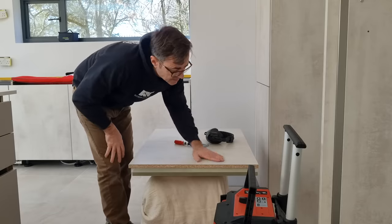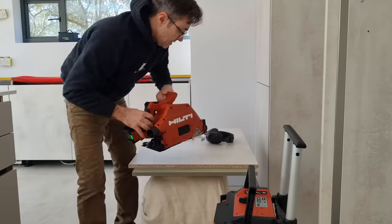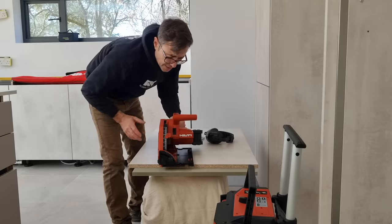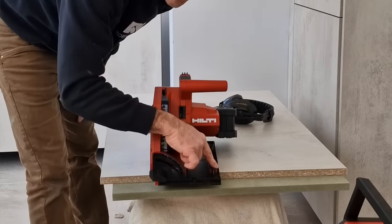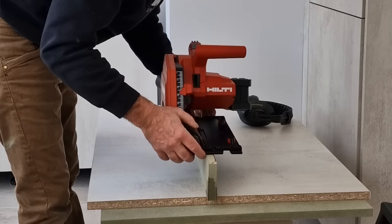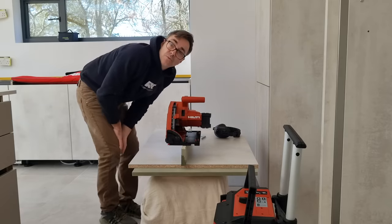This saw is really nice and really well balanced. Let me demonstrate what I mean about balance - I'll take off the extractor. When you're pushing the saw, if it's heavier to one side it'll tend to steer in the rail, so you'd adjust using the two small adjustments. If I stand a piece of MDF here and put the center of the saw on it, I want to make sure it's as close to center and standing up on its own as possible. You can see that we're roughly in the middle of the overall width, and I think that's super important.